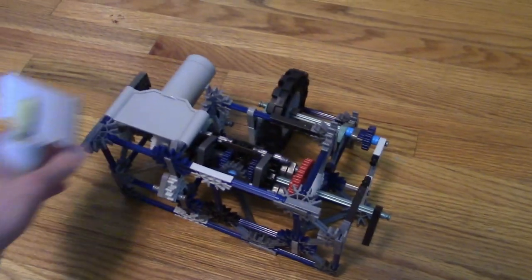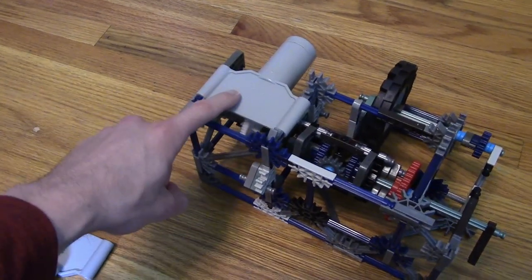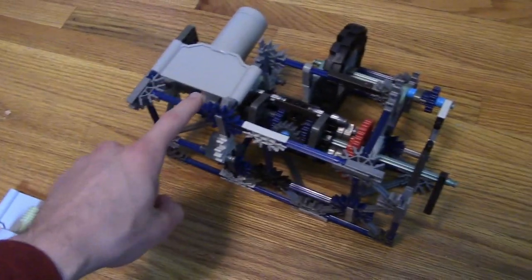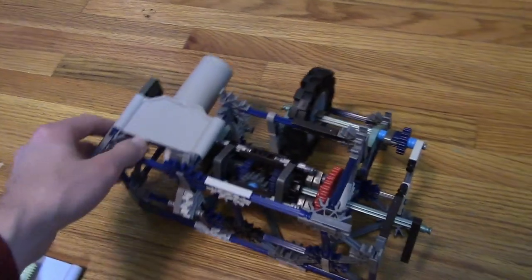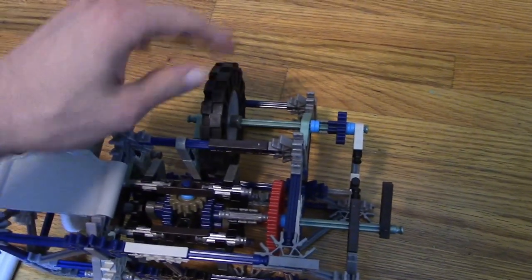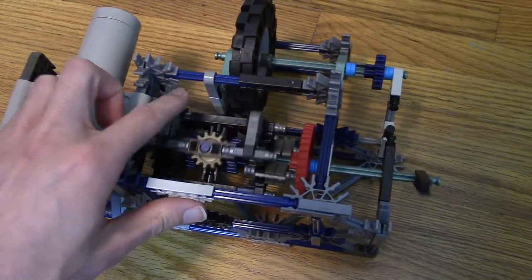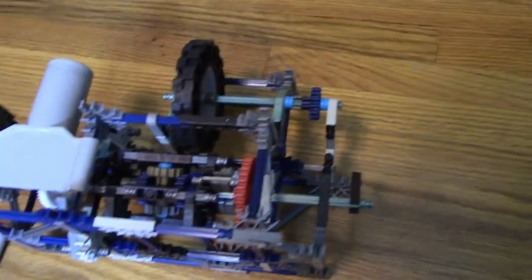So how am I going to do that? Let's just say that this motor is going slightly faster than this motor. To keep them at the same speed, we can just turn the output of this motor off for some time and then turn it back on. And that's what I've got going with this differential here. For now I can just ignore this wheel up here — just ignore that whole top section, I'll explain that later. But this differential allows this output to be turned on and off without using a traditional type of transmission.